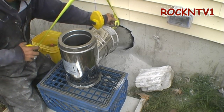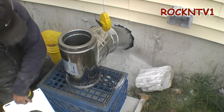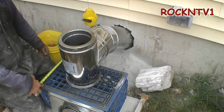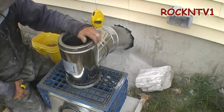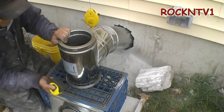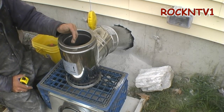Down here at the combustibles clearance I'm reading two and three-quarter inches. Because of the bracket thickness — about an inch — I have to make my own triangles out of eighth-inch angle iron, and those are going to be about 29 inches off the building. I'll put diagonals on it in both directions to make it rugged. The chimney weighs about five pounds six ounces per foot on my bathroom scale, which lines up with what Selkirk says — a 36-inch piece is just under 17 and a half pounds. I wanted a straight shot with no outside elbows so when I go to clean it, I can clean it properly. The professional guys wanted to do a 30-degree angle around my overhang instead of cutting it — I didn't want that.